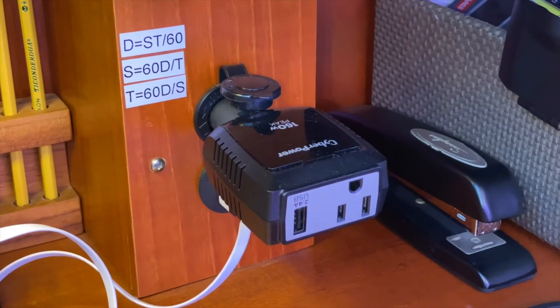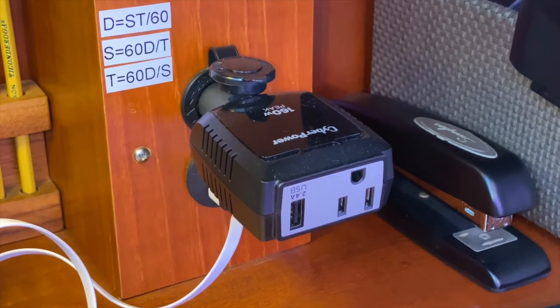The boat has been really upgraded to make it almost like a home in terms of connectivity throughout. We've added USB connections throughout the entire boat — in the aft stateroom, the salon, the nav station, and the forward peak — allowing us to charge phones or iPads, or even use an iPad as an anchor watch system. We've also added 12-volt DC cigarette lighter outlets in all these locations, so you can plug in a small inverter and run or charge a laptop without drawing from the main inverter.